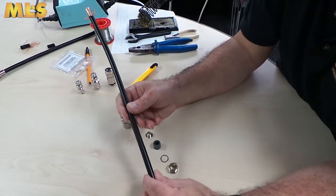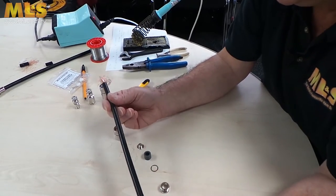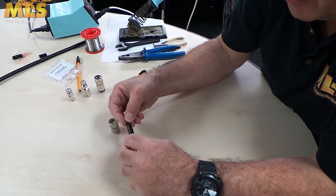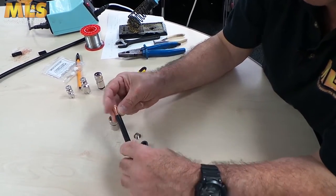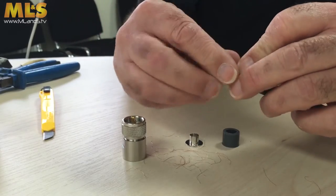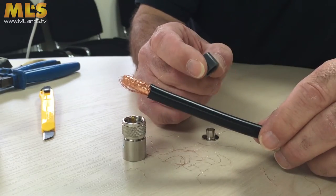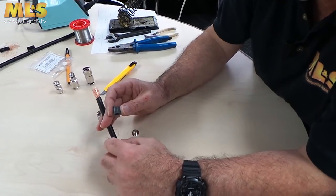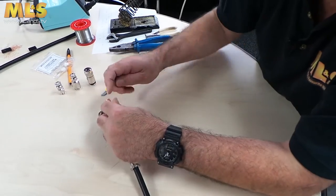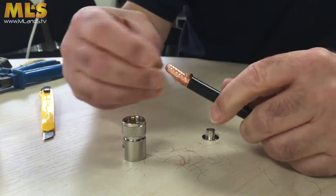One thing I said in the last video is that the first things that you do is remember to put all the back stuff on. Otherwise, if you forget - if I had done this - you've got more bits to assemble and it will be a right pain to take it off again. So start off with the back nut, then the washer. Now this washer has to go on next, and the reason for that washer is basically it allows, once you've got the rubber gland on there, if you didn't have that washer it would be very difficult to do up that back nut. Then put the rubber bit on, nice and tight, and push that down.